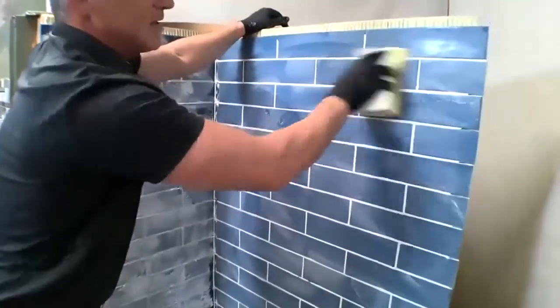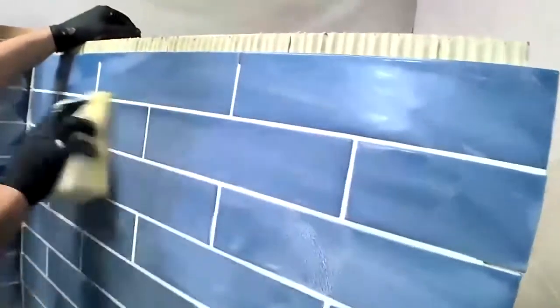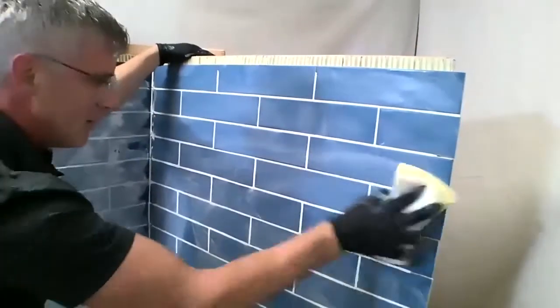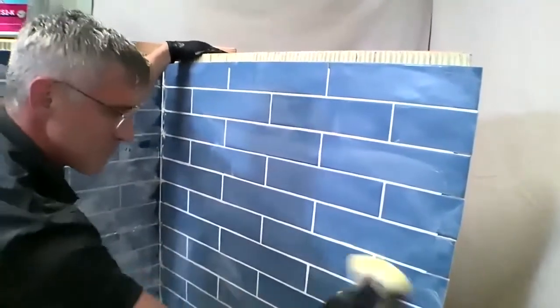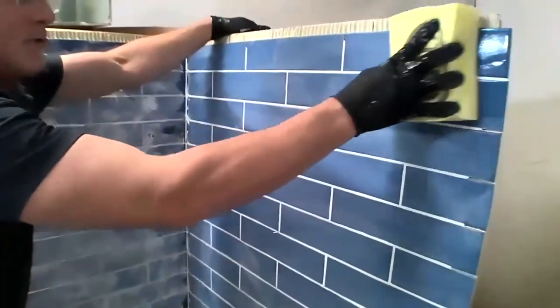So now, once I've done my dirty wash across the entire surface, now I'm going through and just tooling those grout joints. Because I waited and didn't wash immediately, as I wash across them, notice they're staying nice and full, and I'm able to actually work them down and dress my grout joints and make them look really nice, full, and keep them clean. Now, as I come across to do my final clean,